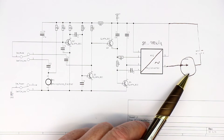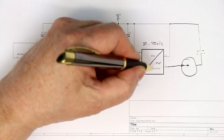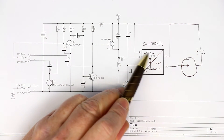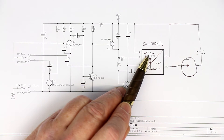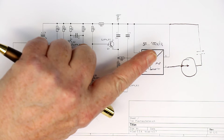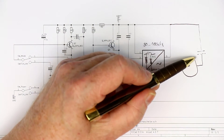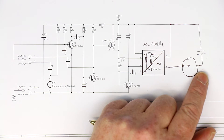This phenomenon you encounter quite often. I've already demonstrated in another video that even an isolation transformer is not 100% isolating — I will link that in the description below. A transformer has a primary winding and a secondary winding with a little parasitic capacitance between them, so for AC voltages it is not 100% isolating. You may have also encountered this with radio or TV receivers: if you bring your finger near the antenna jack, reception starts because your body serves as the antenna. Even with millimeters of air between your finger and the jack, capacitive coupling can pass a signal.